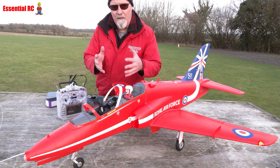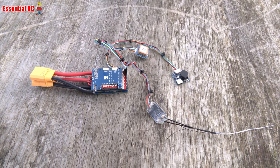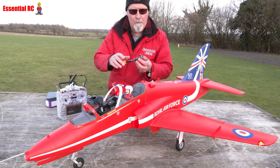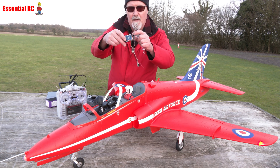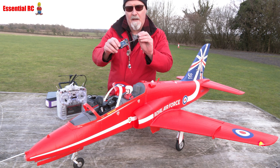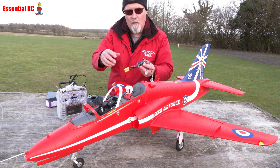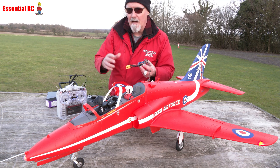The second thing I wanted was all the telemetry in the goggles. I'm using a Matek 743 flight controller which provides all that telemetry — ground speed, altitude, and my bearing back to home because I've got a GPS unit connected to it. I also have a Crossfire receiver connected, and a separate USB connector so you can flash INAV firmware onto the flight controller and configure it.